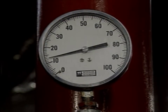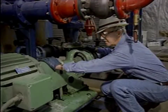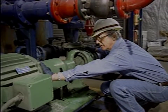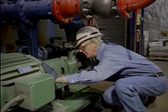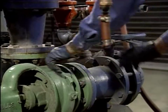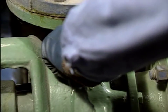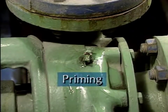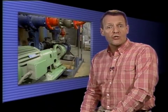These checks often include checking the pump's suction pressure and discharge pressure, checking the bearings for excessive vibration or overheating, listening for unusual noises, and checking the pump for signs of leaks. Venting the air from the pump while the suction valve is open will fill the pump with liquid — this step is often referred to as priming the pump. The discharge valve on this pump remains open when the pump is shut down, so it's already in the proper position to run the pump.